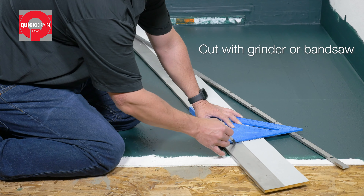Next, set the tiles on the floor and let it set up before working on it. Measure the distance for the cover — be sure to deduct wall tile thickness on each side. After cutting the tile-in cover to the correct size, place standoffs on either end and set the tile-in cover into position. Loosen the screws on the adjustment panel and let the tile edging drop all the way down onto the top of the tile-in cover. Retighten the screws. Remove the tile-in cover and set the tiles on all walls.